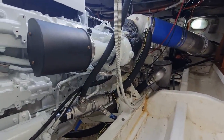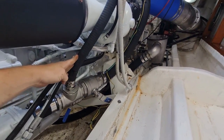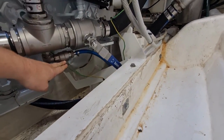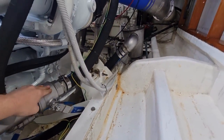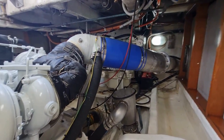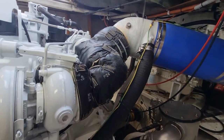As we come down, we have the water outlet here with a couple of diverts. The top one heads to the cooler for the pot winch hydraulics. We've got a stern tube line tucked in down here and then the main line out to the wet exhaust riser — running a 10-inch wet exhaust, with a small dry section that's very well heat blanketed.